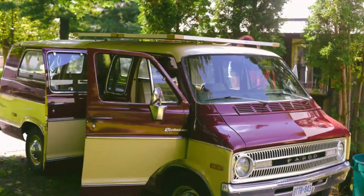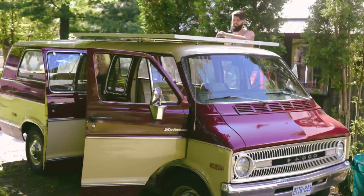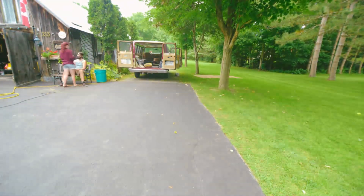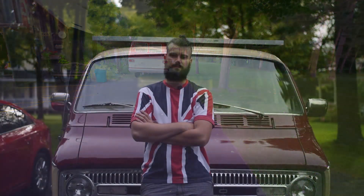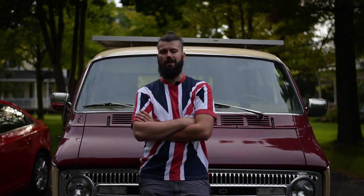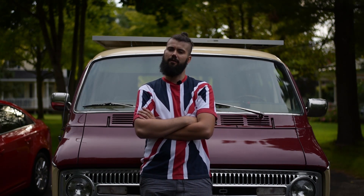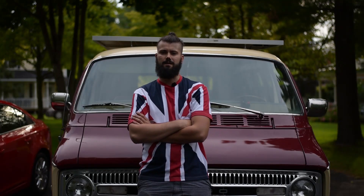The panels themselves aren't all that heavy, but they are definitely unwieldy, so you're going to need some help putting them up if you're doing this kind of job yourself. We mounted them very simply with rubber washers, rubber grommets, drill-through posts, and spacers — four mounting spots for each panel. We wanted to keep the holes in the roof to a minimum and caulked each hole as we were laying them in, so hopefully we won't have any dripping.